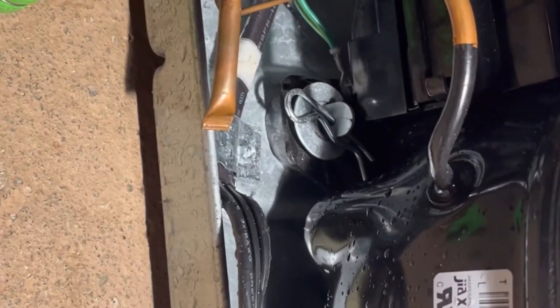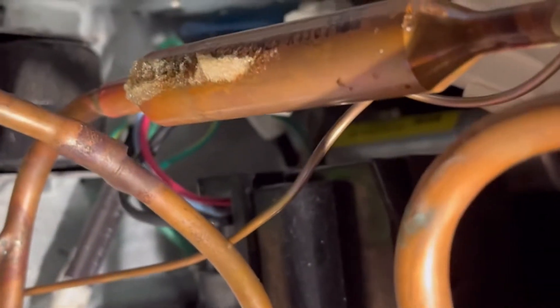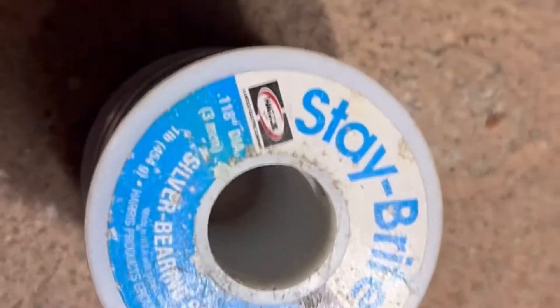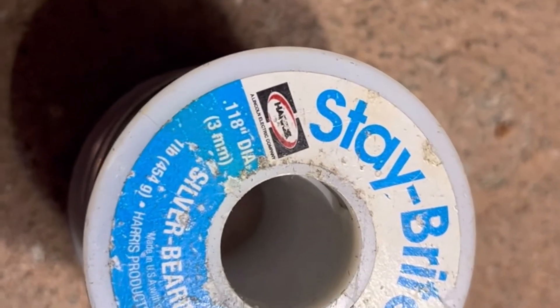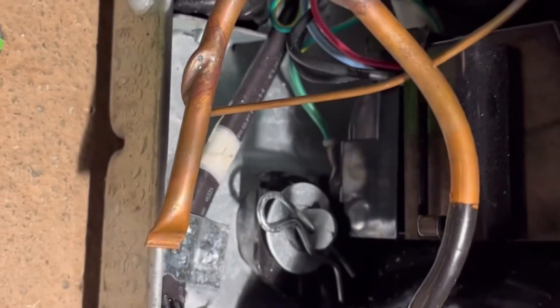If you are attempting this, you can use flame — just have to be super careful. I do have a resistance brazing unit which is flameless, but today I'll be using my torch. I'll be using Stay Bright, which is a low-temperature solder, so it makes the job a lot safer and is very effective — about 10,000 PSI strength, more than sufficient.